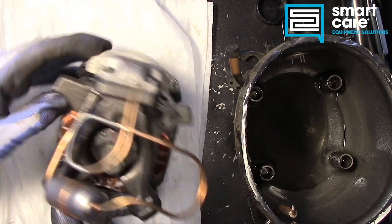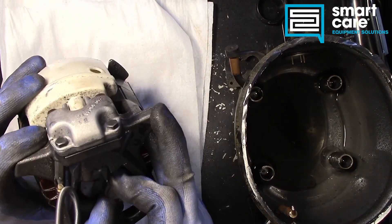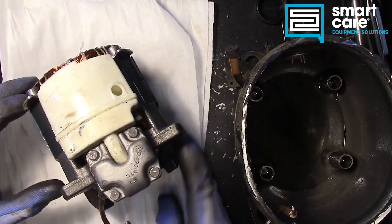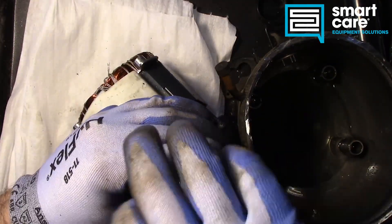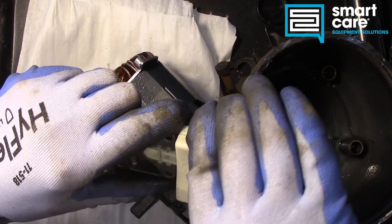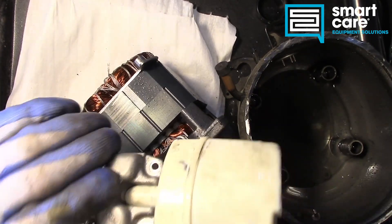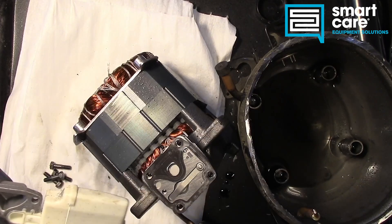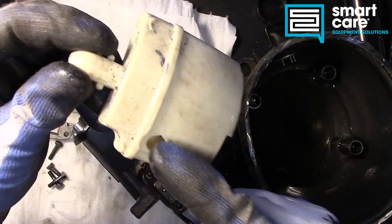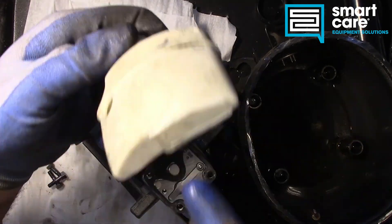This does not want to rotate, so I'm not sure what we've run into — it may actually have damage. I think we're fighting with the valving; you can hear the valving opening and closing. Being a new compressor, it's pretty tight. Let's get the valve cover open. It looks like what they're trying to do here is prevent liquid from getting back into the inlet — this whole thing creates a kind of trap to prevent liquid slugging.